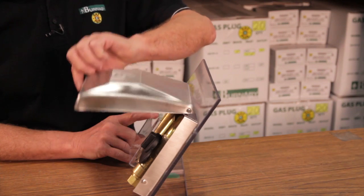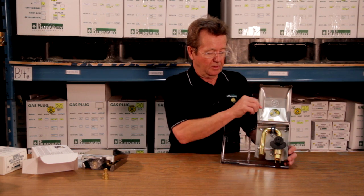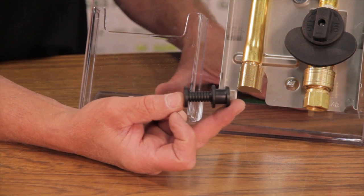The cover of the box opens up 135 degrees so it's easy to work with. It also comes with standoffs — these adjustable standoffs come with every stainless steel box. You can adjust them from three-quarters of an inch to one and a half inches. You'll use those on particular siding installations, or on a rough wall — a brick, block, or stone finish — anything that gives an uneven finish, to support the box off the wall.